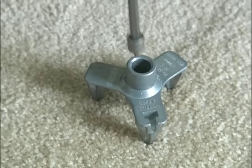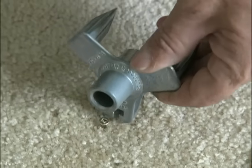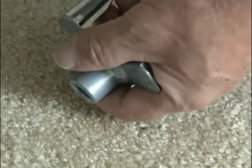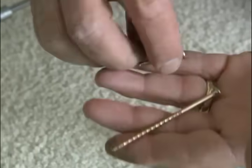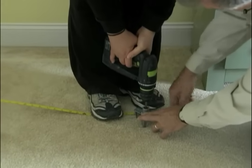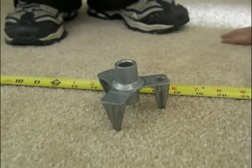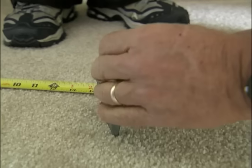Now the screw stops off the carpet. In the tripod there's a little attachment that I can hook onto the screw head and snap it off. Now try to find that screw — push down hard, can you feel it? No. That's because this screw is designed to break away at the same spot on every screw, just below the surface of the subfloor. Now all I have to do is put these screws all over your floor and you'll be tight.